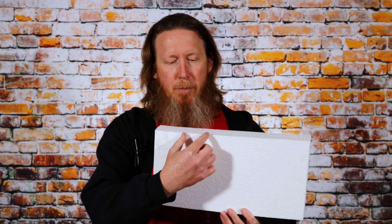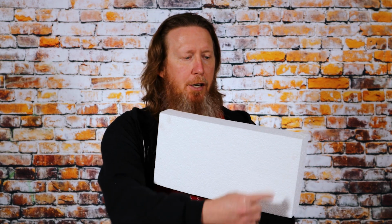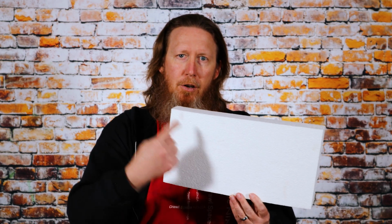So what we use in that situation is you could take a roll of our two-sided butyl tape and actually create some sticking points for that foam board first. Let's pretend this is the wall, so maybe you put a strip of butyl tape here, and then you spray foam here, here, and here. That way, when you apply that foam board to that brick, it's going to instantly stick with the butyl tape, and then that adhesive is going to set up and make it permanent.